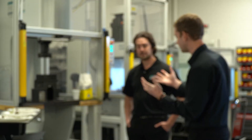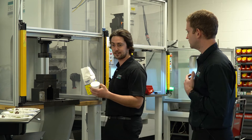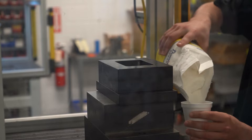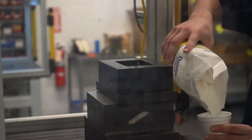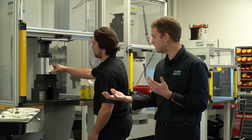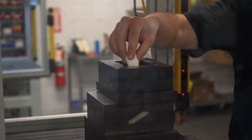Sam, why don't we set up the first test? Let's do it. Can you go ahead and pour some sugar in the cavity? We'll pour it in here — just so you guys know, we're using the same amount of sugar each time, and we'll go to different forces each test. We're going to be using a die set. The first test we're going to apply 40 kilonewtons, the second test 80 kilonewtons, and the third test 110 kilonewtons. We'll use this to see what comes up with the best results.